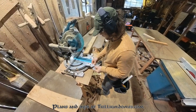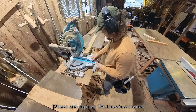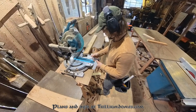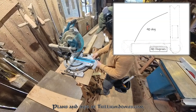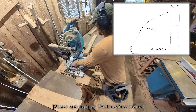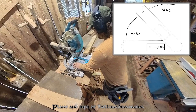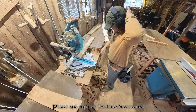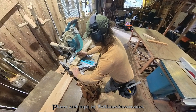Now we need to make the rails for our jig, starting by cutting some blocks at the bevel angle. I'm using my digital angle finder — you close it all the way and zero it out, then open it up to 90 degrees and zero it out again. Then you set it to the angle from the plans and it reads just like your saw does, so you can use that to set your saws or scribe a line accurately.